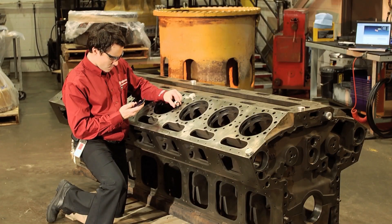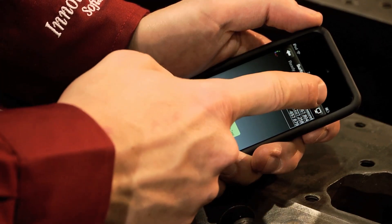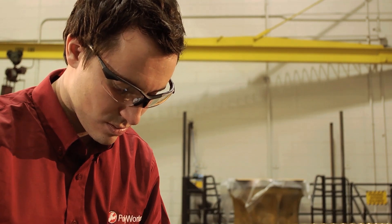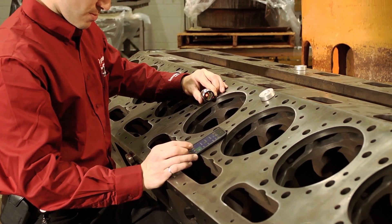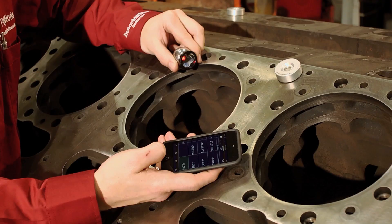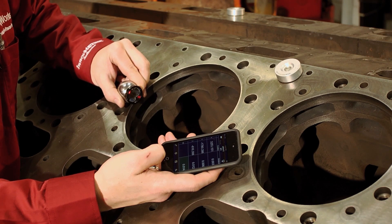While the digital readout is available in the 3D scene, in DRO display mode you can view single or multiple DROs in full screen on your mobile device. This is particularly useful to see the position of your probe. The DRO display mode is fully exploited when using the PolyWorks Build Inspect functionality. This tool gives you a real-time distance display of features — using this combination you can accurately build a fixture in minimum time and precisely mount a component on a part or even inspect its features.